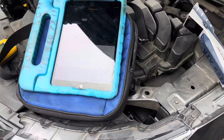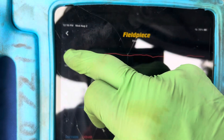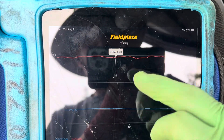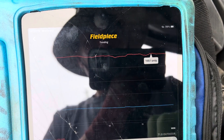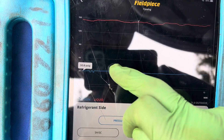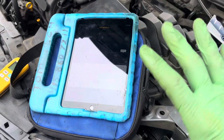For the guys who like to look at pressures, let's get some pressures. The pressures are almost a straight line with just a little wobble, just under 150 — 146, 146, 144, 148 — basically just under 150, constant. Same with the suction side: 30, 32, 30, 30, 32 — constant, very steady.